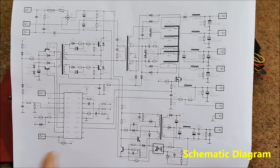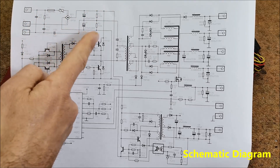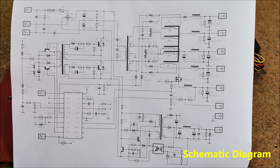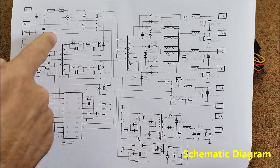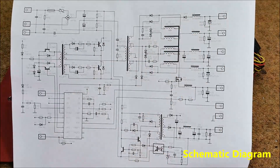First let's briefly explain how the power supply works on a circuit diagram that is basically the same for all power supplies with minimal changes. The device consists of an input part which is a symmetrical rectifier, and also contains EMI filters as well as a fuse and NTC resistor for soft start. Then there is an integrated circuit — usually a TL494 — which represents an oscillator, and together with additional circuitry there is also a protective function which is activated if any deviations in the output voltage occur.